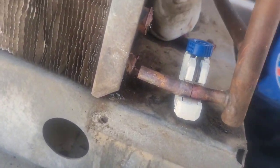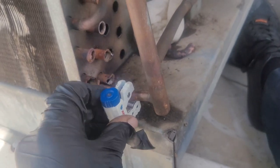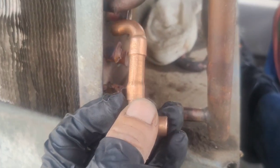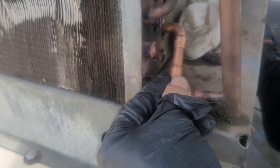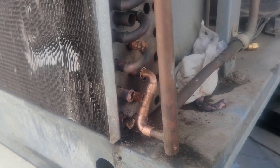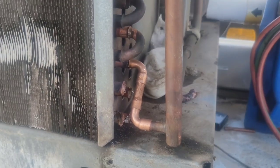Got my shortened stubby cutters on there. Sometimes when you cut these you don't have to go all the way around - even half will work, but going a little more than half is better. If you can't get all the way around, take it off, turn it around, and by reversing it you can get the other side. I got it cut down - this is going to work. I've got space in my couplings to make up the small gap. The coupling slides - bam, just like I planned. It's a little snug but once you get it hot it slides in perfectly.